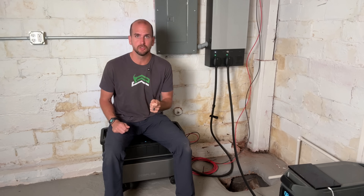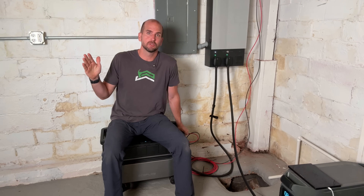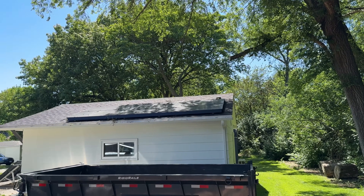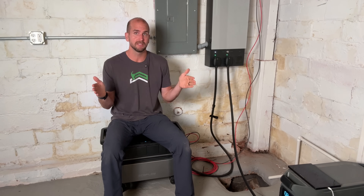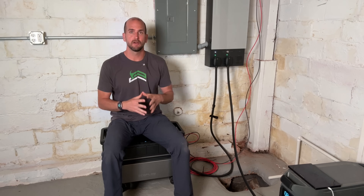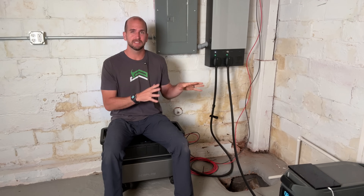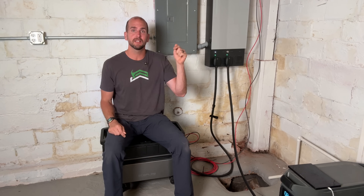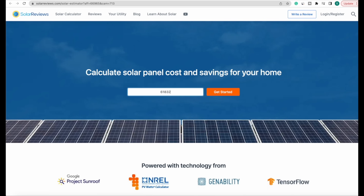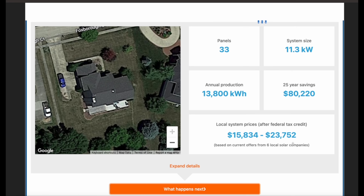I personally have a lot of work to do on the solar side — right now I need to do some tree trimming, which is why I have so little solar coming in. I should be getting 1,000 watts or more, but shading is covering those panels. Once I trim back the tree and add additional solar to the Ultra — with the Delta Pros also getting solar — I might be able to offset my power consumption during the entire summer season. However, this system won't completely offset my power bill: my heat pump in winter has huge demands this system can't meet. If you're interested in sizing a system to eliminate your power bill, there's a link in the description where I sized out a system for my home, including cost after the federal tax credit and return on investment calculations.